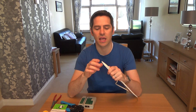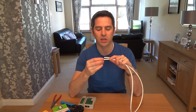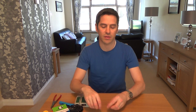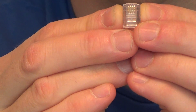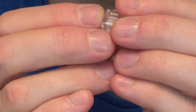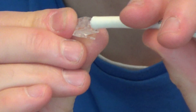It's slightly different — the wiring configuration is the same, but it's very hard to get the Cat6 cable into the RJ11 plugs because the Cat6 cable is so fat in comparison to the plugs. I'm just going to show you the plugs you need because they are different from the Cat5e plugs. Basically you need RJ12 plugs. The ADSL signal only runs down the middle two wires, and normally you'd use an RJ11 plug which is a 6P4C — a four-pin plug. This will work fine with flat cable and Cat5e but because the entry hole is so small you can't physically get the Cat6 cable into it.